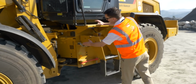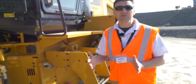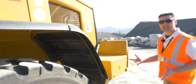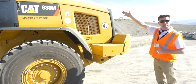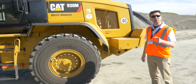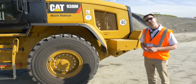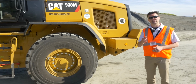Also, we're going to bring guarding to the powertrain components along the front, along the sides, and along the bottom to keep this machine nice and safe. Now, as we progress further back, high debris packages, we are going to bring a cyclone pre-cleaner so that the engine breathes clean. We are going to bring a RESPA system, which is a powered pre-cleaner for the cab so that your operator breathes clean. And when you go at the highest level of debris package, we're going to bring online a sealed and brushless alternator so your electrics breathe clean.